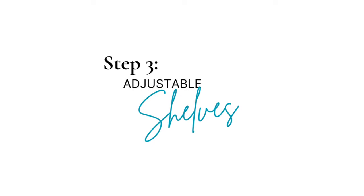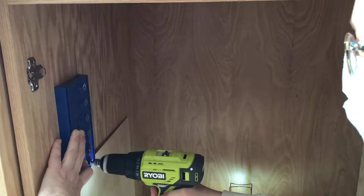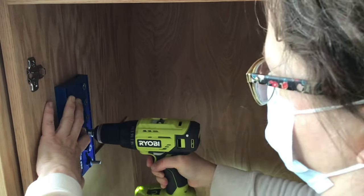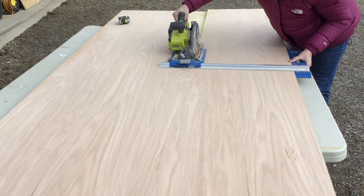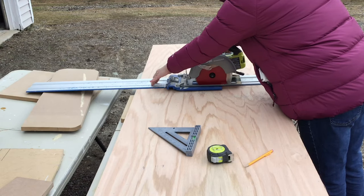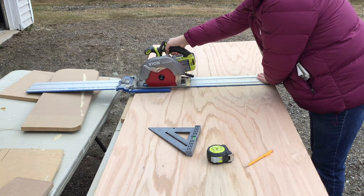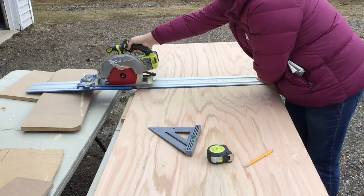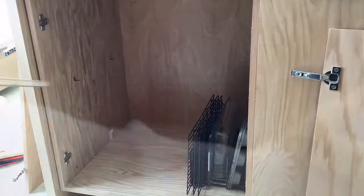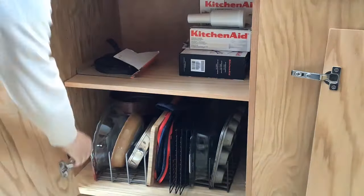Last, I made a couple of adjustable shelves inside my kitchen island cabinets. I used a Kreg Shelf Pin Jig to drill two rows of vertical holes on the walls inside my cabinets. Next, I cut plywood to the interior width and depth of the cabinet for shelves. Keep in mind that if you use bracket-style shelf pins like the ones I use, you'll need to account for approximately 1/8 inch that they stick out into the cabinet, so subtract 1/8 inch from the width measurement when cutting your shelving. I covered the exposed edge of the shelf with edge band, sanded, and applied polycrylic just like I did with the cabinet doors, then inserted shelf pins at the height I wanted and slid the shelf on top of the pins.